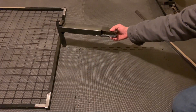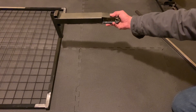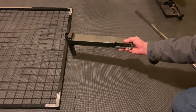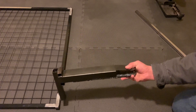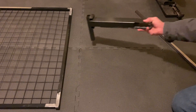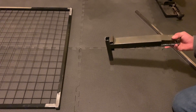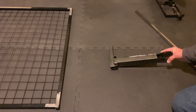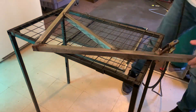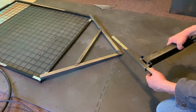I could have just gone with the small square tubing, smaller diameter inside, and have it pulled along like so — but there would be an unnecessary force on this part of the bar. I prefer support on both sides. So what I'm going to do is make a triangle, support the triangle, and attach this to the tip of the triangle so it pulls along this way. That way there's not so much force on one part of the bar — if you get stuck on a rock, it won't break.